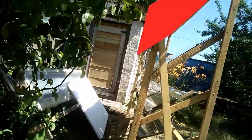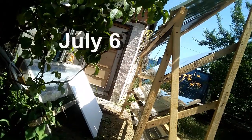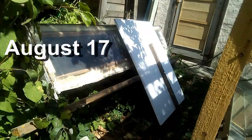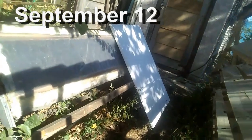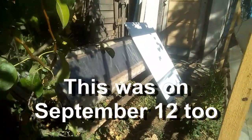Let's pay attention to the shadow from this roof. Here we see the edge of its shadow. It is obvious that the position of the shadow will be higher if the height of the sun above the horizon decreases. We see that the shadow shifted up after one month, and it will continue to move upwards. Also, the period prior to the summer solstice is the period when the shadow moves downwards. The shadow continues to shift up day after day, and one day it begins to fall on our solar heater, reducing its heat production. We can avoid the shadow problem if we increase the distance between the mirrors and the solar heater.